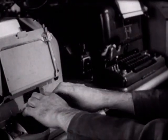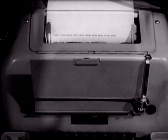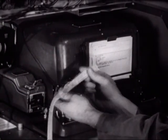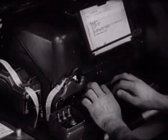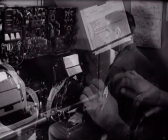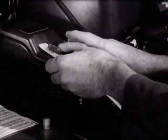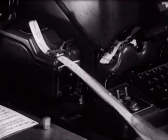The AN/GRC-46 should handle almost any teletypewriter traffic problem, thanks to the flexibility provided by the two teletypewriters. In addition to the page printer's ability to transmit and receive, there is the reperforator's ability to record incoming traffic on tape. Messages typed on the reperforator are also recorded on tape; the taped messages can be transmitted immediately or stored for later transmission. This ability to record a message on tape is advantageous when a message must be repeated to several addressees.